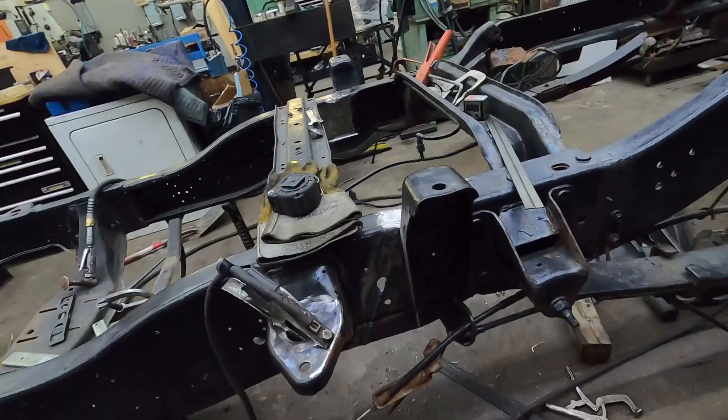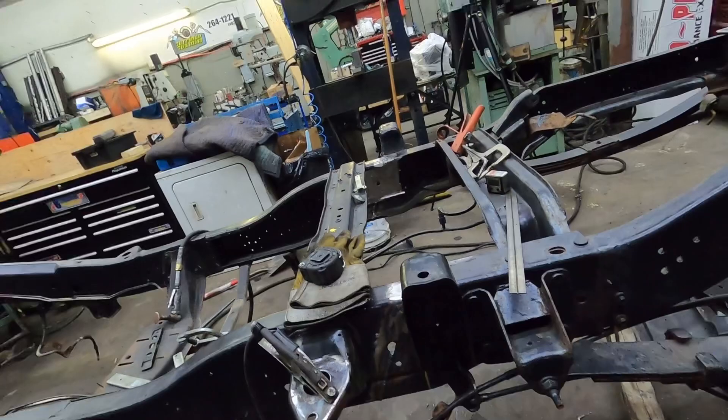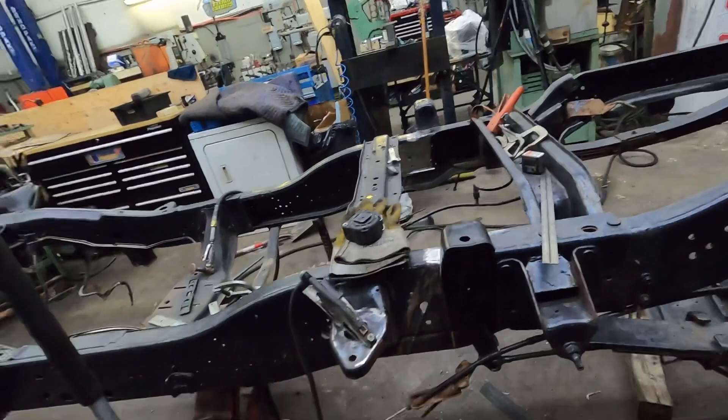So I'm going to put it back into time-lapse. I'll get these all tacked and welded in there, and then I'll get it ground off tomorrow. Like I said, I just don't have the flap wheels - I'll have to get some three or three-and-a-half inch ones. The ones I usually use are five-inch flap wheels; you can get four-and-a-half and smaller ones too. Then we'll get back at it to get that welded in.